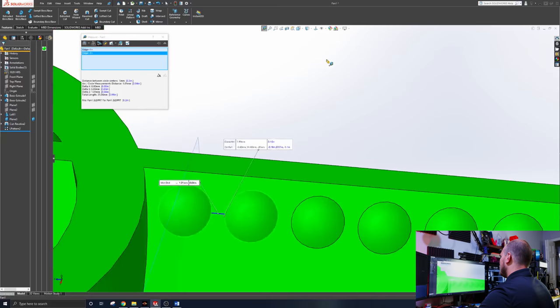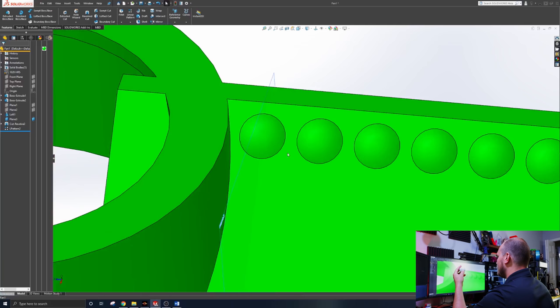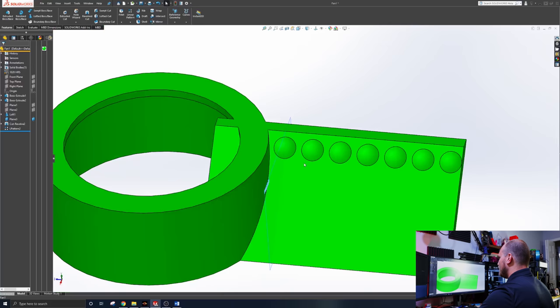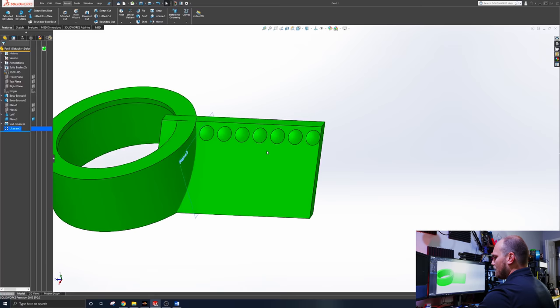So now looking at said golf ball, it looks like we could just do a linear pattern down, which would be fine, but essentially on these golf balls the dimples kind of stack on each other. So instead of just going linear pattern down, we'll stagger another layer of dimples here, and then we'll pattern it. So it looks similar to this, as the dimples almost touch each other.